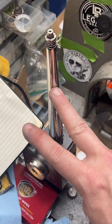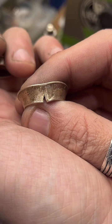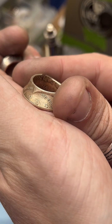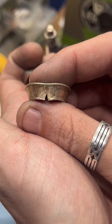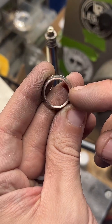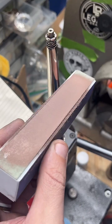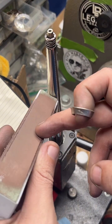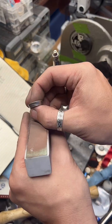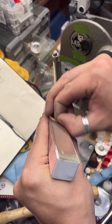So there are two things you can do to keep them from splitting. What she's talking about is like this, right? This is the worst thing that can really happen to a coin ring. Split it. First thing you can do to prevent it is keep this cut edge as smooth as possible. For that, I use nail file blocks, and I just use the roughest edge. It's usually side number 4. And these are perfect for quarter coin rings you just folded. It fits just right. You just smooth that edge.